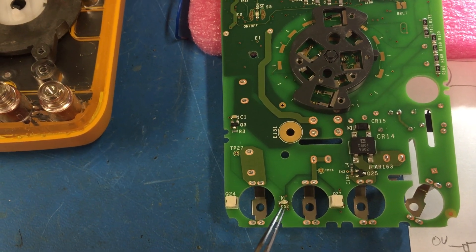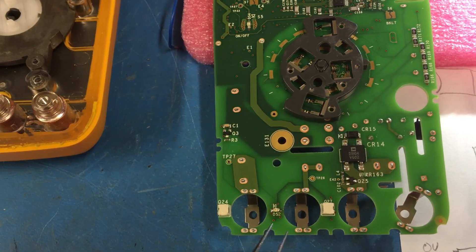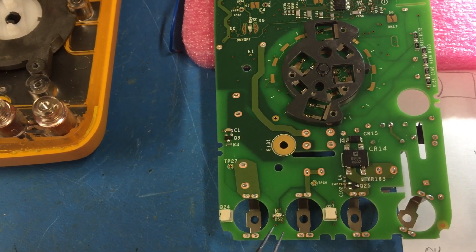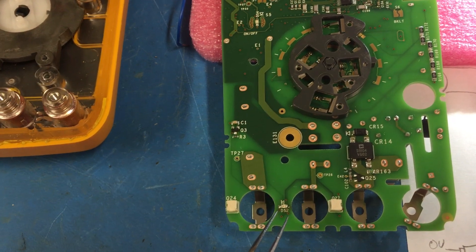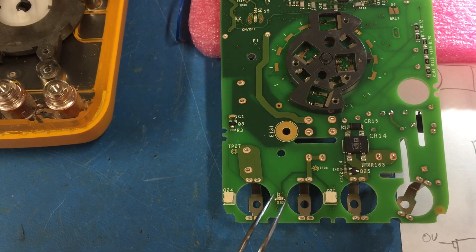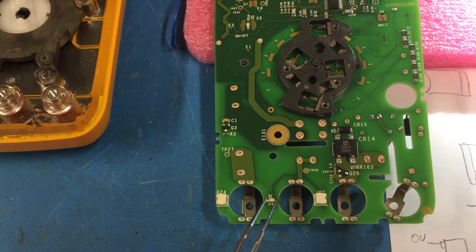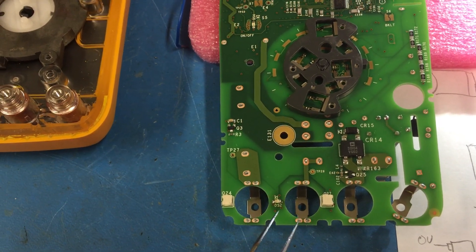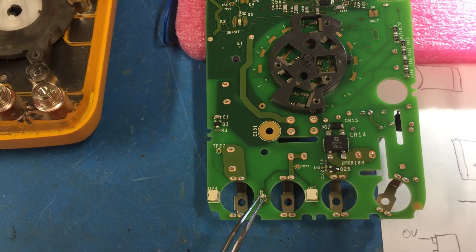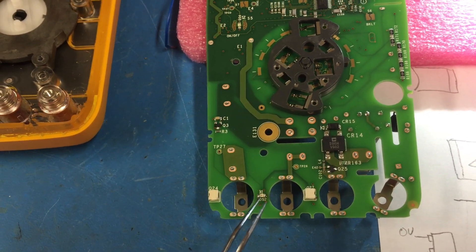In my case the LED was soldered on the board. A lot of people on the EEVblog forum said they found the LED had actually come off the PCB, but in my case that was not the problem. I set up a current-limited power supply to about 10 milliamps and 3 volts, and using the identifier on the silk screen I applied it across the LED terminals. Then using an old digital camera without an IR filter I looked for the blue glow of the LED — and there was nothing, so I knew the LED was not working.